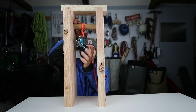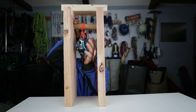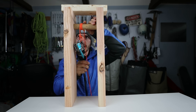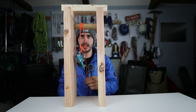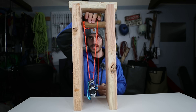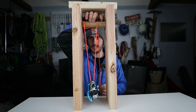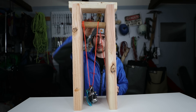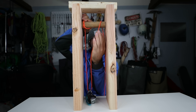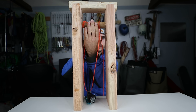He's no longer falling — that's if the dowel doesn't move. If the pulley moves, he's going to fall down. But you have to realize that the more loops you have, the harder it is to pull. In fact, if you have maybe six or more loops, you could pull on this until it falls down or the rope breaks — that's how powerful friction is. So if we start pulling on this, it gets wound up, but as soon as we let go it still falls down. But what if the pull was on this side of the dowel? This side is getting pulled down and this side is getting pulled down at the same time.